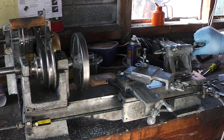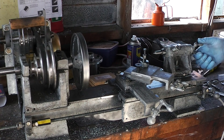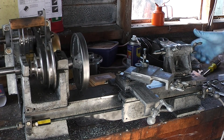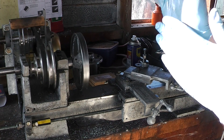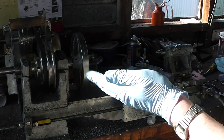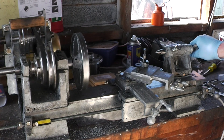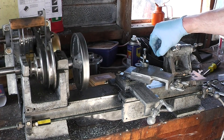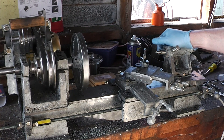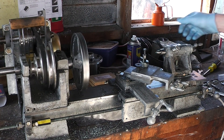The end bell here is actually 7mm instead of the 6mm that the smooth section of the threaded rod should be, because the shaft is actually slightly deformed — so as it spins, it is deformed just enough that it needs that extra half-millimetre radius. I'm actually sorely tempted now that I've got this set up to mount a section of rod between centres and make another one and replace the threaded rod in there entirely.